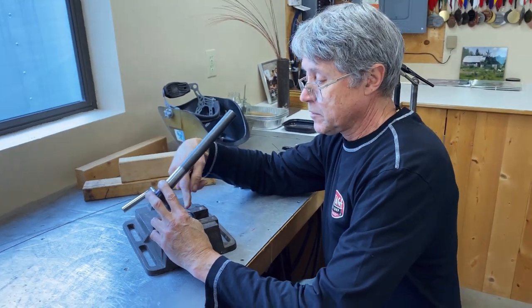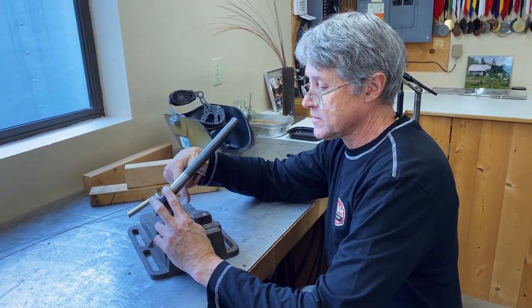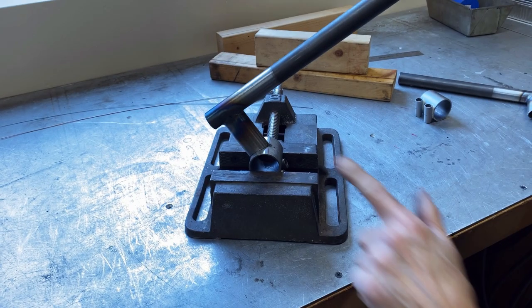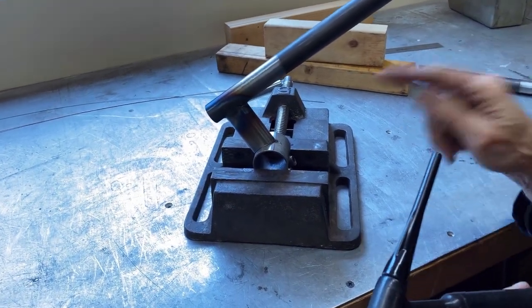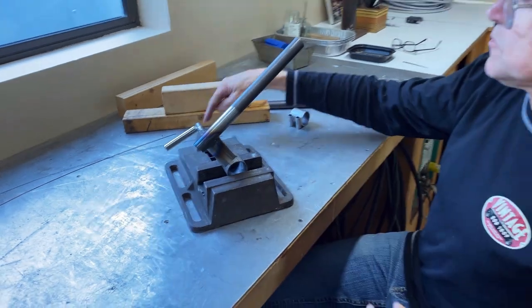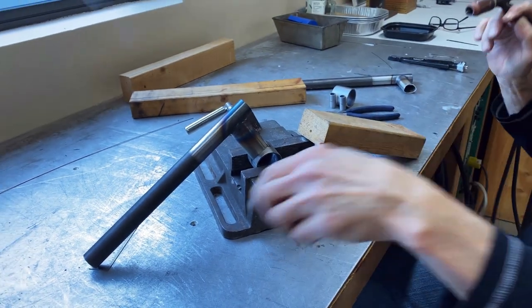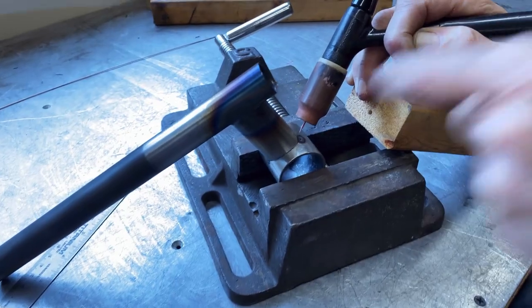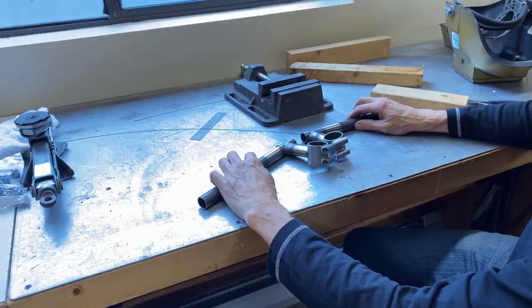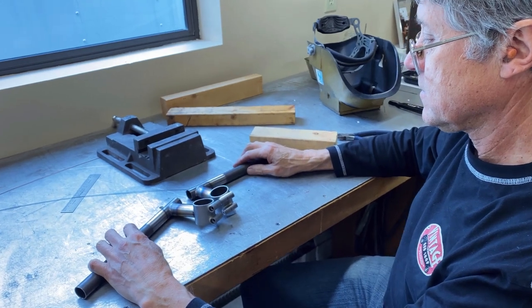I'm going to hold this by hand and put a little fusion tack there - I don't really have a way to clamp this onto that. That's just a little fusion tack; I didn't use a rod, I just melted one piece onto the other. I'll take it out carefully because it's not held by much, then use the rod and put a tack on the other side. One last look to make sure everything is symmetrical - we've got the pinch lugs on the outside. We don't want pinch lug outside and pinch lug inside - that wouldn't be good. So I think we're going to weld them up now.